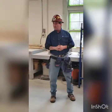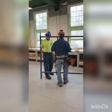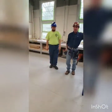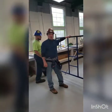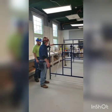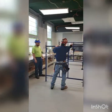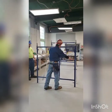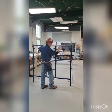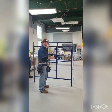George, I'm going to need your help with this one. Once we put this together, we want to make sure that the frames are in line and our walkthroughs are on the same side. We don't want the walkthrough facing left on one frame and right on the other. We can also use this to elevate our work platform — on the top we can have a storage platform. We want to make sure these ties are on the same side, together.